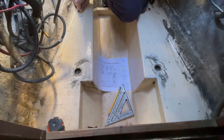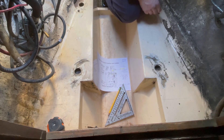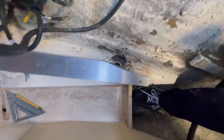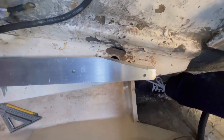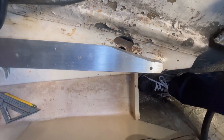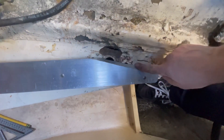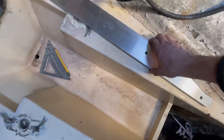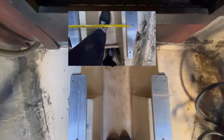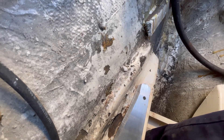So per the diagram, it's important we have five-inch marks — it's old but it's true. We need to make sure the front and rear mounts are 16 inches apart across the pan, and 17 and a quarter inches apart longitudinally. Looking at our plates, you'll notice that there might need to be a cutout in the flange to clear the mounting plate. We have the seven-inch 45-degree over-cut. We're five inches aft of the bulkhead, but we're currently at 15 inches on center — we need 16 — so half an inch over for each of them. That means there might not be enough space up there.